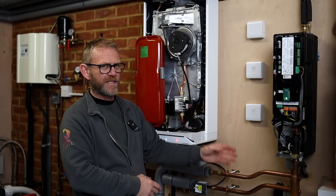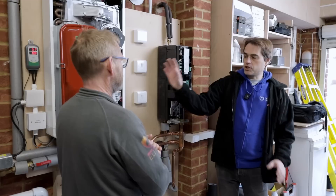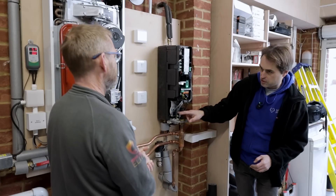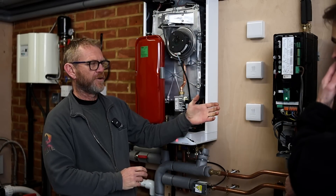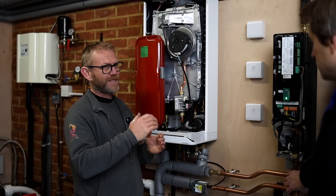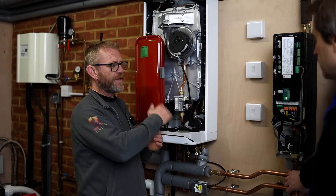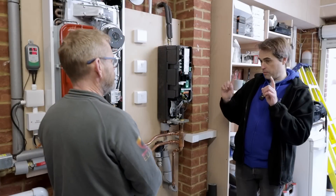What you see here is what comes with the kit: the Extend unit, the outdoor unit, and a close-coupled tee which has been designed and made by Intergas. This is what I think is causing a couple of issues at the minute. Originally the boiler was running the whole house — it was the master unit. As soon as you connect an air source heat pump to it, that becomes a slave, because we've got a pump in this unit. So the boiler is teed in just to supplement the heat pump.